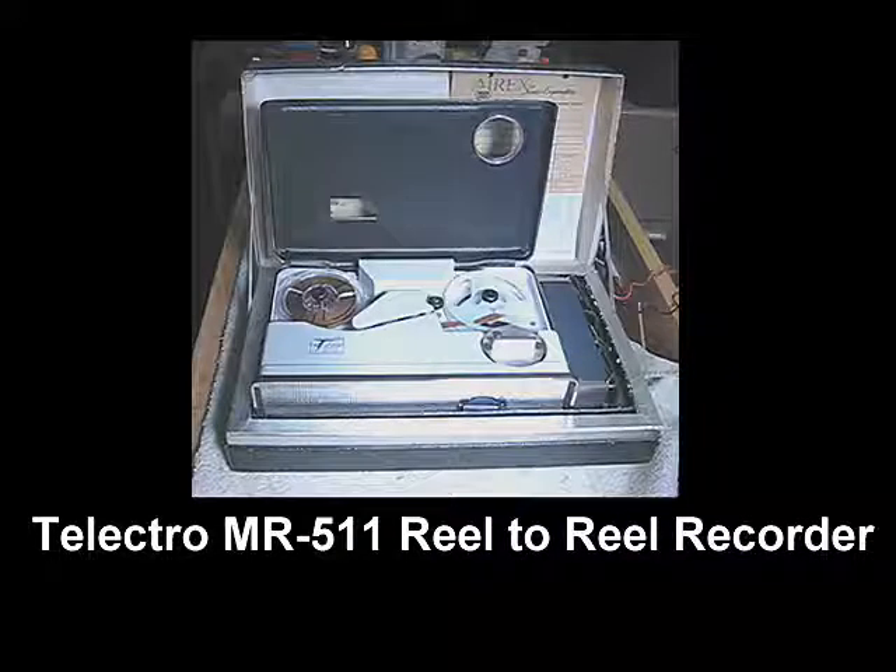This little gem runs on 10.5 volts, which is unusual, uses 3-inch reels, has two speeds, AC bias — which is very unusual in one of these early tape recorders — and it just sounds absolutely wonderful. On the very side there, there's a little blue stripe on the right side. That's actually the microphone that snaps into the handle. You pop it out of the handle, you dictate or do what you want with it, and then you can store it in the handle. It's a really nice machine.